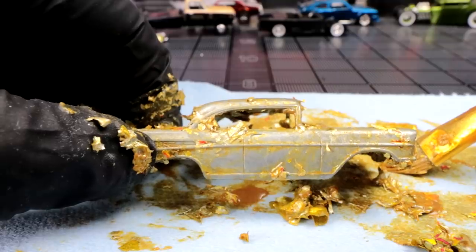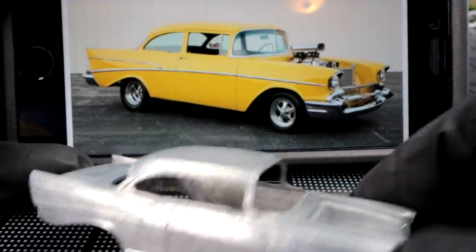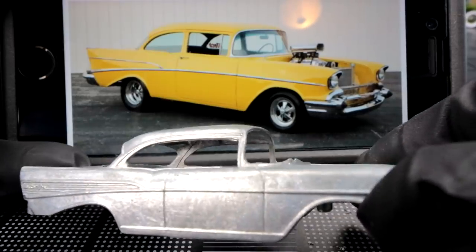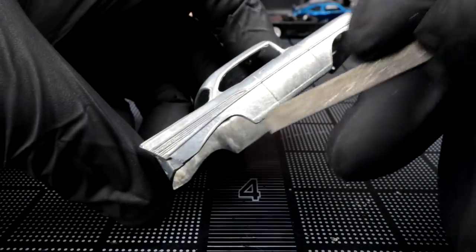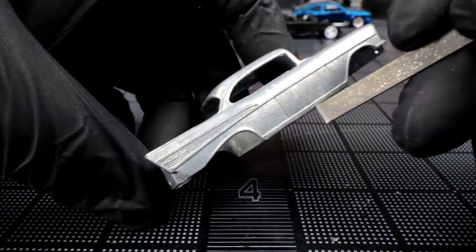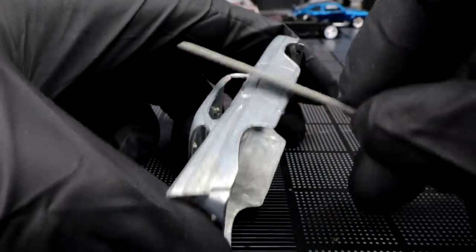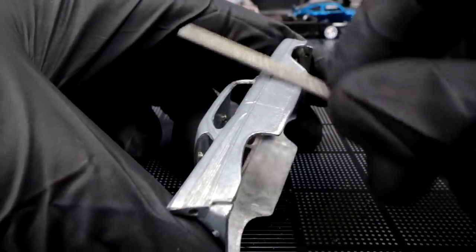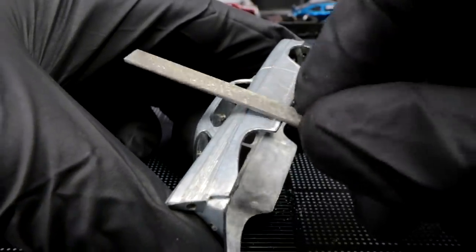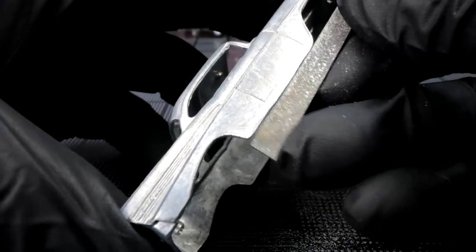I think I've taken this far enough — I'm gonna go give this a scrub with a brass brush and some hot soapy water, get all this cleaned up. Okay, so we've got a little ways to go trying to make this look like that. We've got some differences to take care of — down here on the bottom, on a Bel Air there's a big aluminum trim piece and our 210 doesn't have that. So we've got to smooth that out. I'm just going to take some of this off with a file, and you can really see how uneven this casting is at the bottom, so we're going to true that up as well.